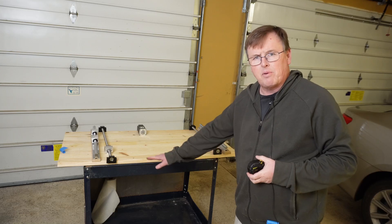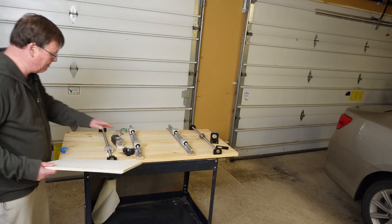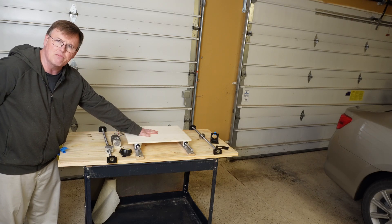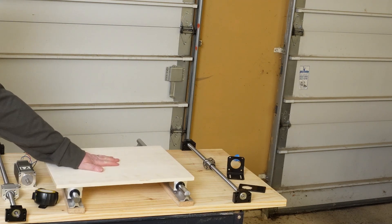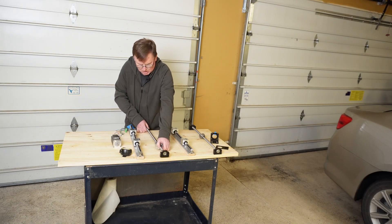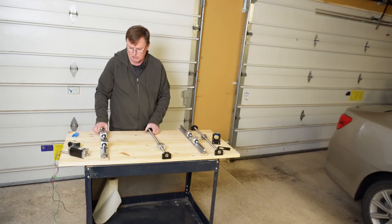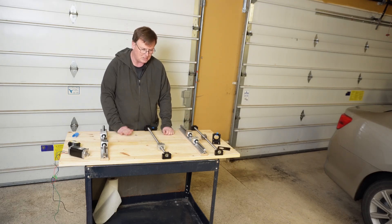This cart is going to be the platform on which I'm going to build my CNC. It's 24 by 48 inches. If you do this type of CNC design you could have a platform that's mobile. This is very different than my first CNC — it's more like what you see with a lot of 3D printers: a central platform that moves. You can make it whatever width you want, put your ball screw in the center, spread the rails all the way to the very end, and get a tremendous amount of capability with a relatively small space.